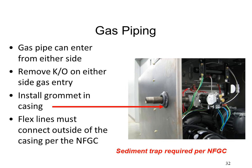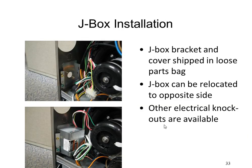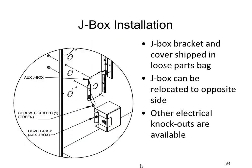For gas connections, you can take the gas on the left or right side. There's a grommet in the loose parts bag — you make your gas penetration, knock out, put your gas pipe in, put the grommet on, and then make your gas pipe connection. If you go out the right side, inside the cabinet you're making a 90-degree turn, another 90-degree turn, and then the gas pipe moves out the right side of the cabinet. Electrical is easy — wires are flexible — and there's a little junction box mounted on the side of the unit that you can move to the other side if needed.